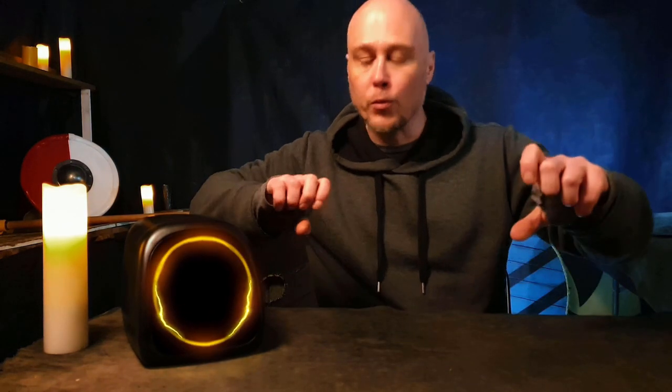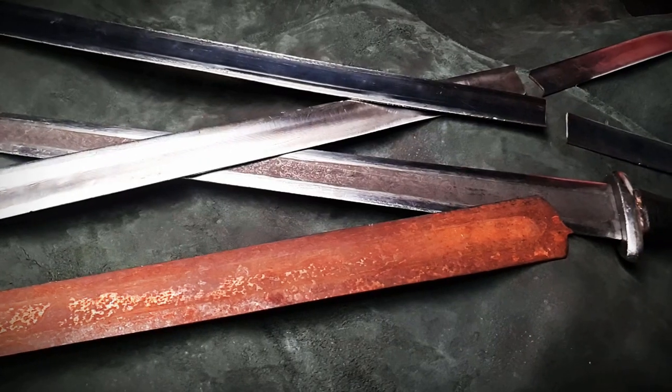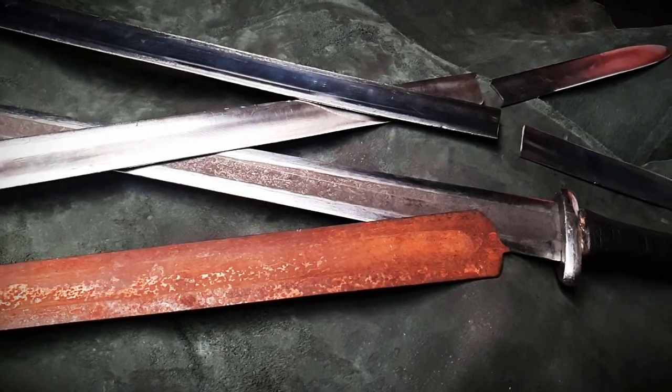Breaks can still happen because the steel can get fatigued from being bent previously, have pre-existing cracks, forging flaws, poor heat treatment, or have a pocket of silica or other material. We have methods today that use giant sheets of steel that have been pre-refined, but back in the day we couldn't refine as many impurities out. So in the east, blades were folded to create a nice lamination so any impurities were spread throughout the blade rather than concentrated in one section. In the west, the same was done by twisting, so all impurities were twisted and bound like a rope, supported by the whole structure of the blade. But in regards to not bending far enough or fast enough, it's usually a combination of the two.